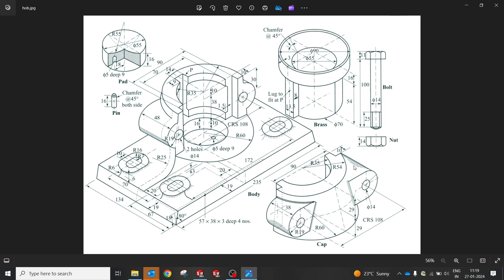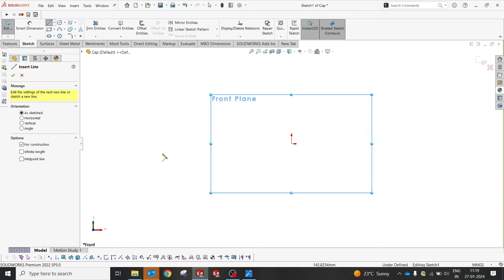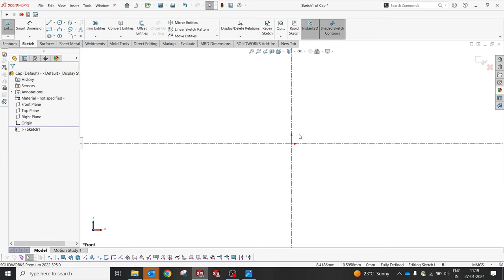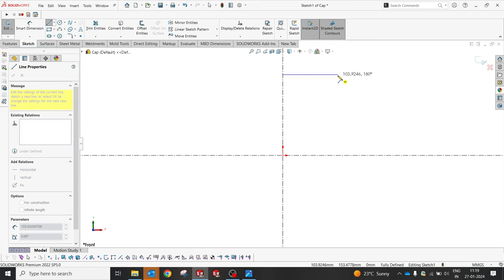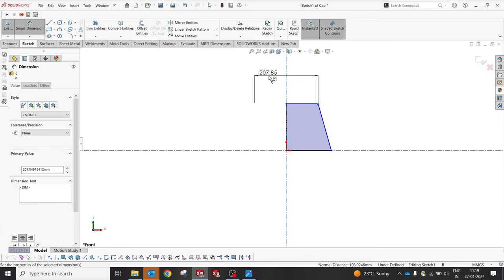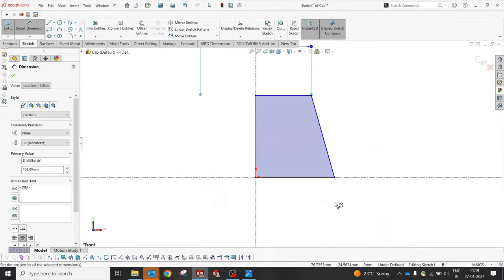So we'll do a revolve and extrude. This time I'm going to show the option I was talking about before when I was creating the body. Let's create one complete revolve, and we'll do an extrude cut, then extrude, and then go for a revolve. From here, I'm going to select this from the center line. We're going to make a dimension of 54 into 2. All right, 54, yes, and 60, right? Okay, fine.